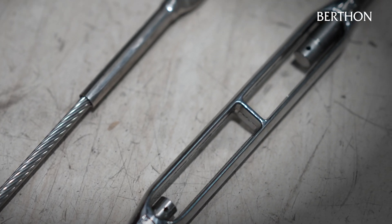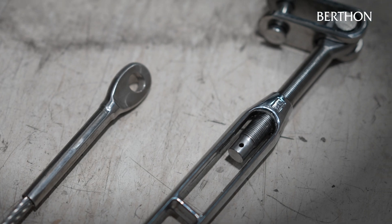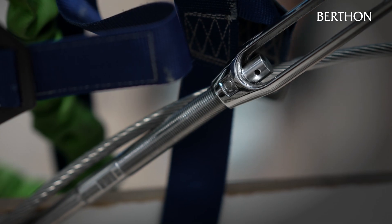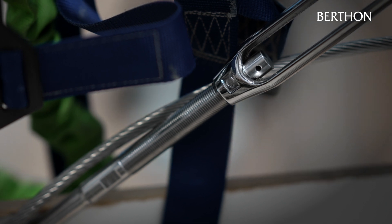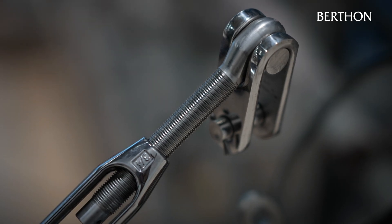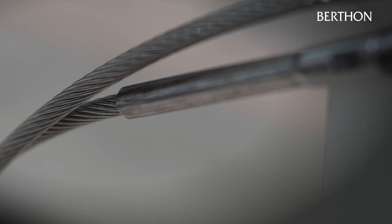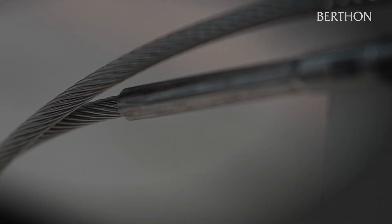You can't eyeball a straight mast — some people try, and other people put a halyard down. But I prefer knowing that if I've made the rigging, I know those two stays are the same length. So we set both rigging screws to 350mm, then just bring it all down equally from there, and tune the rest of the mast from under.